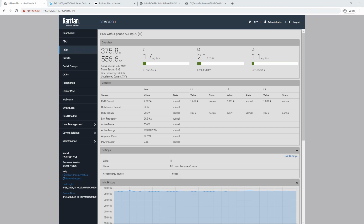The thresholds would be very much dependent on your risk tolerance and also how you have loaded the rack, as Duncan said. If you're in an 8.6 kVA PDU and loading it really close to the max, then you cannot afford to have a lot of imbalance, so you would need the threshold much lower. Whereas if you are at, let's say, 30 to 40% of the capacity of the PDU, then perhaps you can have a little bit more of a lenient threshold. Hope that helps. And if others on the call have any best practices or guidance based on your experience, that'll be great as well.